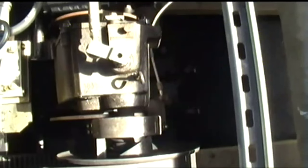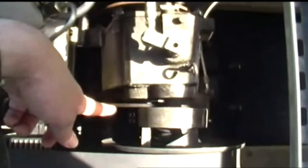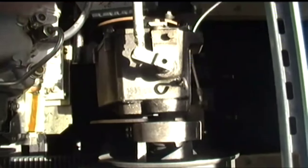Now, I did strip these brake calipers off a few years ago, and freed them all up and so on, but I didn't strip them into two halves. See, they seem to have a line down the center, and if you unbolt these things, they have a gasket in the middle, if I remember rightly, and you can split the caliper in half. So it could be that I need to spend some time stripping them down and doing a really good service on them. You can see they operate on these inboard disc brakes, which are each side of the transmission.